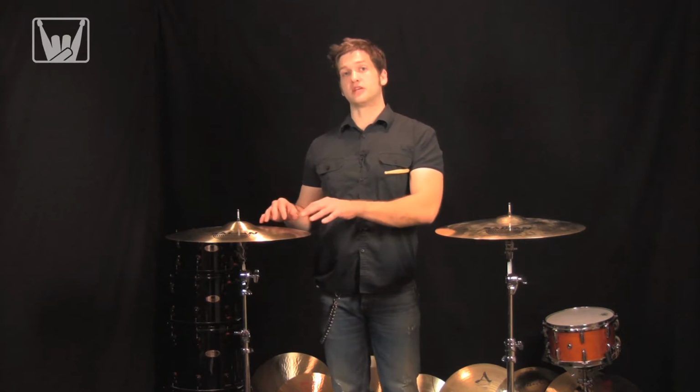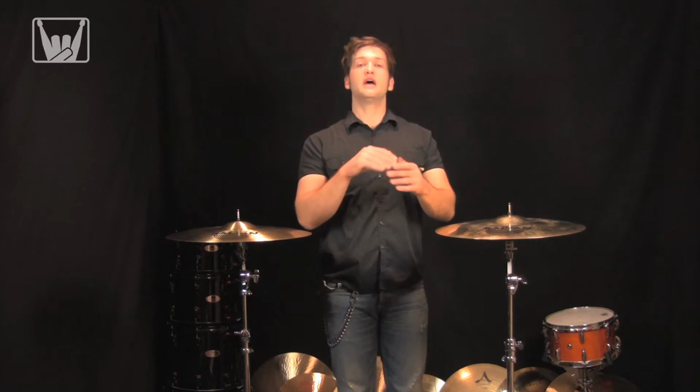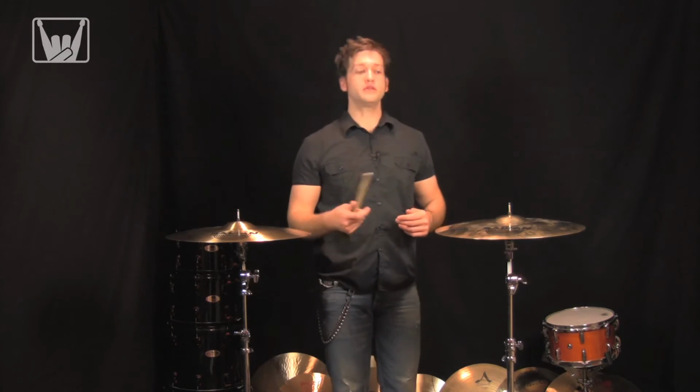If you hammer a cymbal, wherever the hammer mark lands, that spot in the metal becomes slightly denser. So now you've got the sound wave moving out from the bell and encountering those denser spots in the cymbals, and it has to kind of go around them. So now not only do we have a skipping motion coming across the cymbal, but also a swirling effect as well. I'm going to go ahead here and hit the regular lathed one.